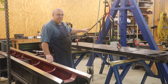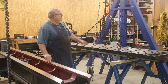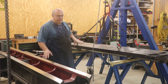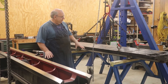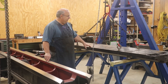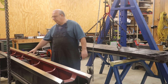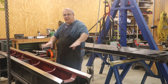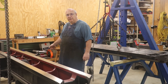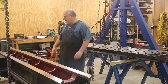My table — I've moved it in here. I had it in storage on my welding table for the last several months. I've got it sitting up on my heavy-duty sawhorses, and I've also got the gantry crane here with a lifting sling where we can pick it up and move it over. This table weighs about 1,500 pounds — almost three quarters of a ton. I did go ahead and put the rack on the bottom so it'll mesh with the bull gear in the machine. When I put this on, I'll need to slide it back and forth — there's no way to move it by hand, but hopefully I can move the pulleys and with the gearing on that rack, I should be able to move it back and forth to get a good print.